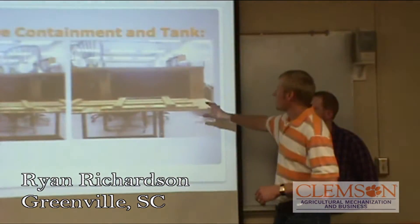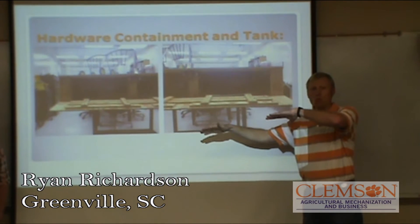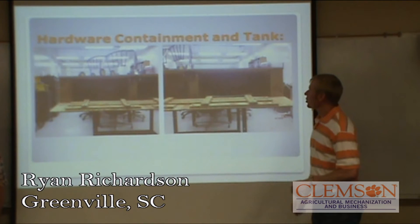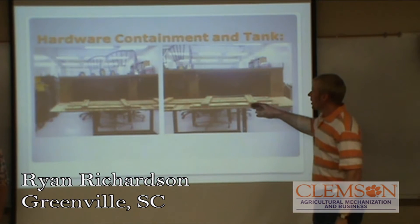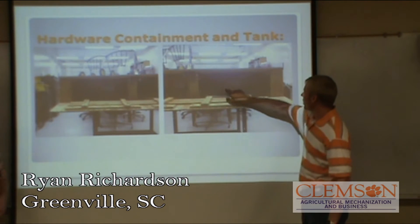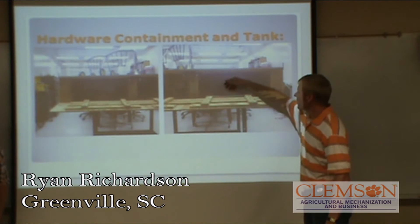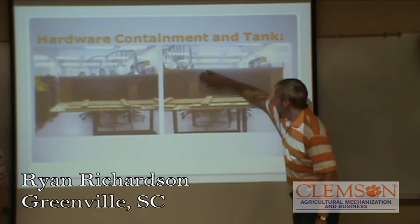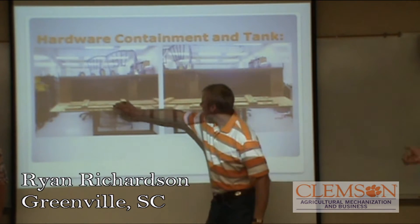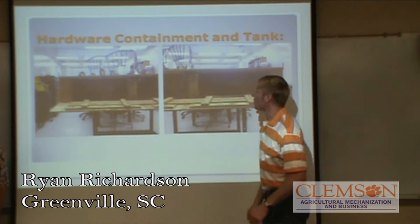So what we did, we built the box, and we had to build it so that we had a sloped corner so that we could have adequate water drainage once the pumps run and operate. You can see we've got our tank in here, and we've got our pumps mounted in the tank — all that's self-contained. We've got a little bit of wiring that comes across, the PLC power supply is up in here, and the PLC controller is right there to operate all of it.